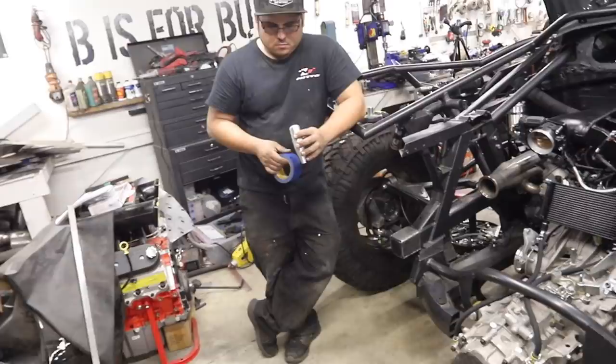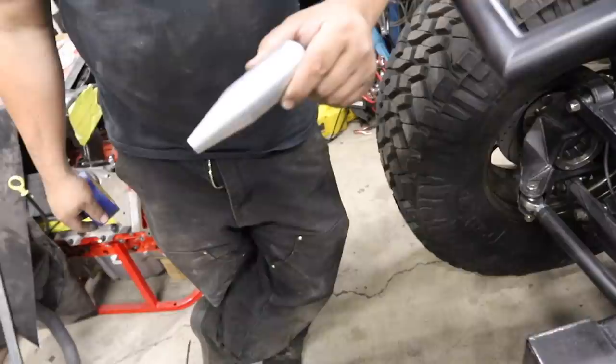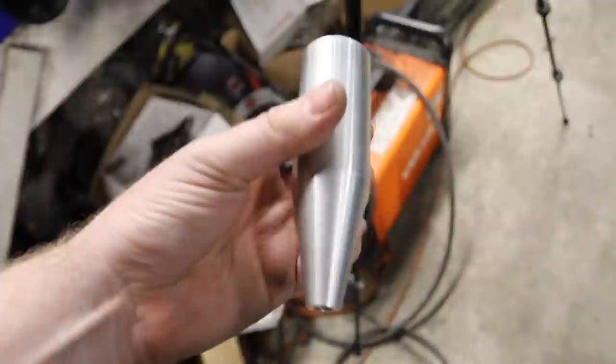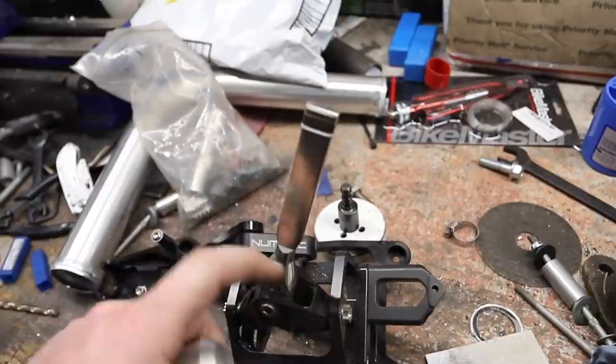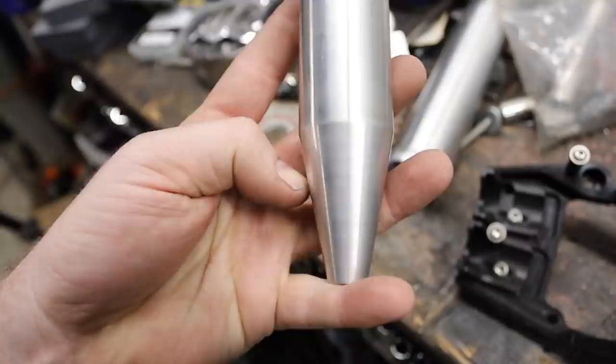Oscar's working on something special — a sponsor sent in a shift knob, but I don't think it's going to make it here in time, so we're going to try and make our own. Now that we have the mill and the lathe, we can do a little bit more than we used to. This was the original shift knob that Oscar's dad made us for the Burnticon, then we replaced it with one with a couple more grooves. This is a Porsche-style fitting that normally accepts a press-on, but we're going to use a slide-on with set screws inside the groove. Oscar's going to cut this off, make a channel within it to house the shaft, and then drill some holes for set screws.